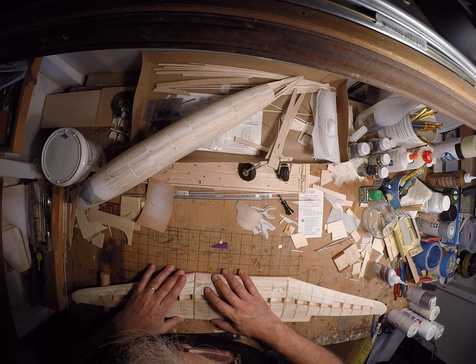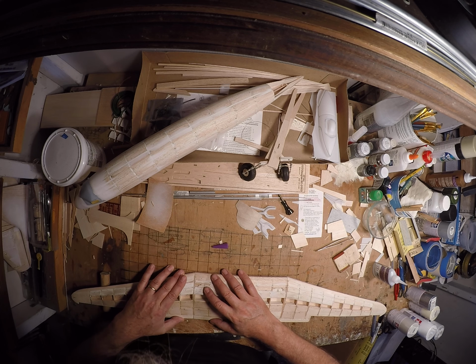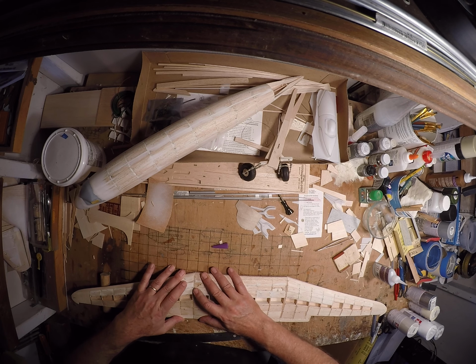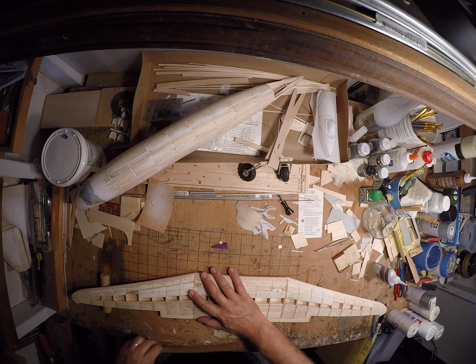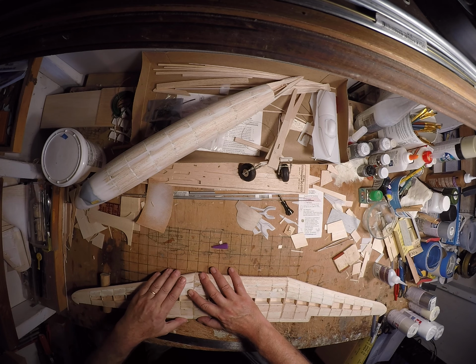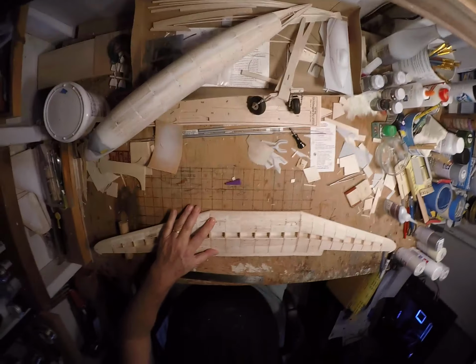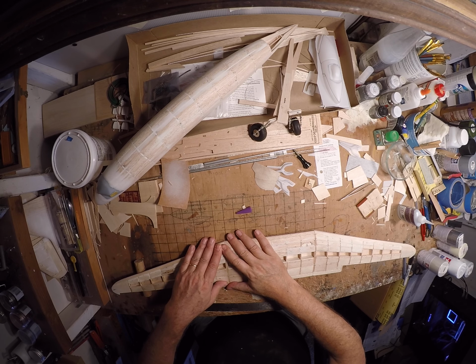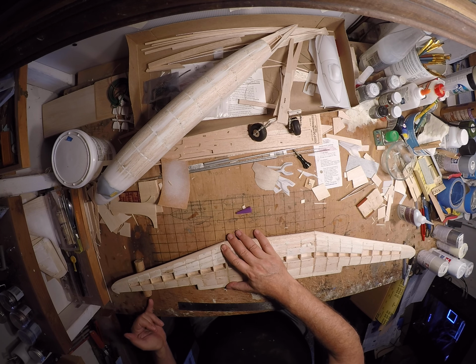Make sure we're straight here, and we're coming in nice and even. Attach the wing right there. Double check the measurement. We should be dead on. 1.5 inches. So this is how I tend to do these. Use a length of dowel, something less than your net total wingtip dihedral, roll it in and out to get to your mark.